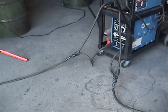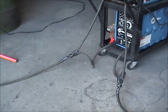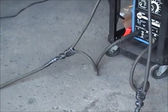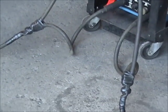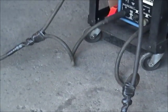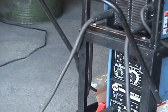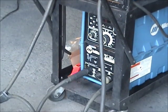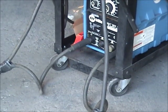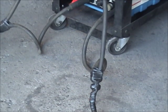I took care of taking all the lead off the handles. Now you guys can kind of see how the leads are both coming together into one connection there, and then the other connection is right there. Going back towards the machines, you can see how they're hooked to the front — positive to positive and tied together, then negative to negative and tied together. That's the basic setup for how to parallel the machines.